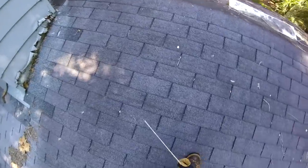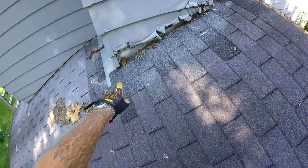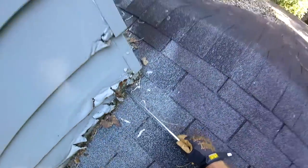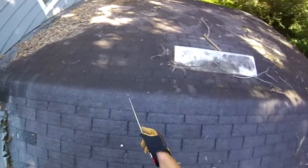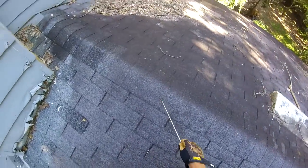Another common theme I see is that this chimney flashing is absolutely rusted out — you can see the rust right here, we need to change that out. We will remove these off-ridge vents; this little four-foot box puts you a more functional ridge vent all the way across the ridge. Exposed nails here — that's a leak.